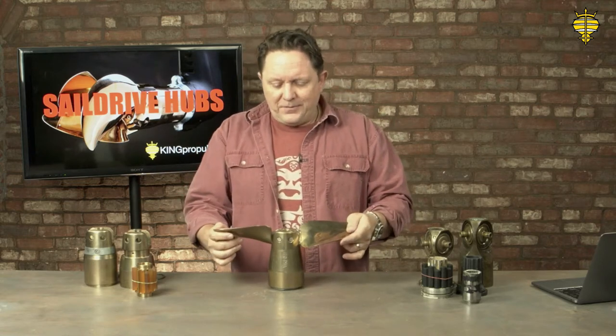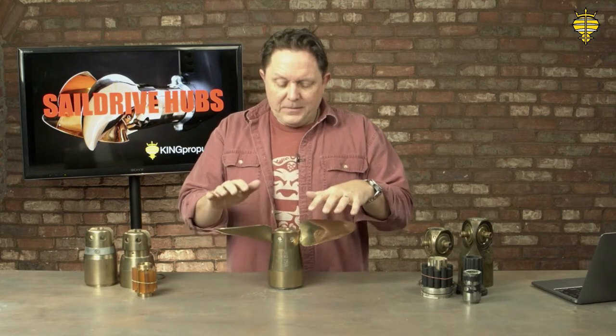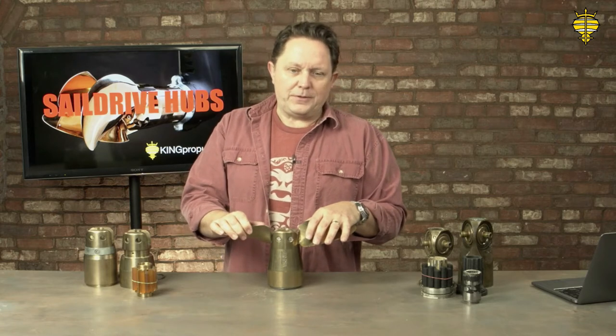The benefits of the sail drive — there isn't really that much in terms of efficiency by losing the shaft and going to a sail drive, because you introduce separate gearing systems. More shafts and transmission systems run at 98–99% efficiency, so there are some losses in transmission, but that's not really the purpose. The nice thing is it's very simple. Propellers are very easy to take off because it's on a spline rather than a keyway and taper. Another hidden benefit is that prop walk is reduced — prop walk is a function of shaft angle and also the hull. Sail drives are normally a 90-degree leg, so the prop is normally pointing straight forward, so you're not getting the cylindrical wake collapse that creates a side force. Typically, owners with sail drives say they don't experience much prop walk.